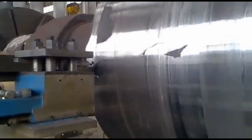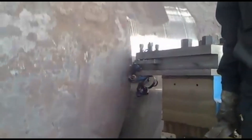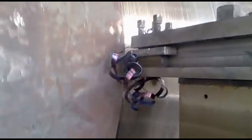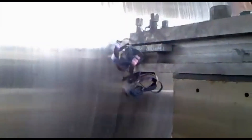The primary requirement in machining such massive parts is dimensional accuracy and surface finish. Heavy-duty face lathes are equipped with advanced control systems, often CNC or PLC-controlled, that allow for high precision and consistent operation. The guideways and other key moving parts are designed to minimize wear and tear over prolonged usage, ensuring smooth and stable movement. These machines often have hydraulic or pneumatic tailstocks and steady rests to support the component during the machining process.